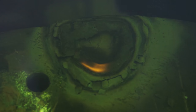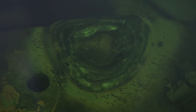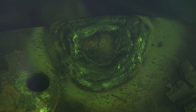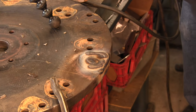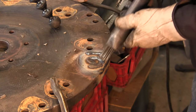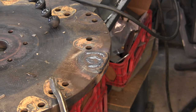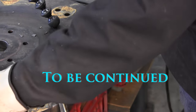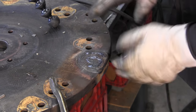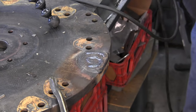Okay, we've got some loose flux there — I'm going to knock that loose and get it out of the way. That is looking pretty good — no flies on that. I think that's looking really good. I'd say we've got enough material on there. We've got to let this thing cool down to room temperature and that's about it. I'm not going to bother taking any of these little divots — there are plenty around — I don't want to add any more than what's needed to complete the repair of the surfaces and the two holes for this cutter.